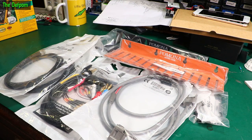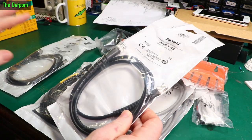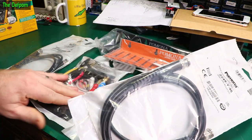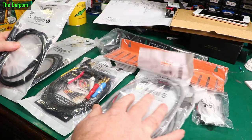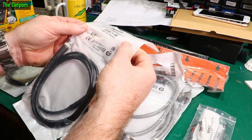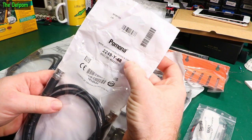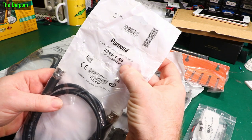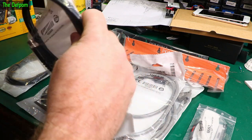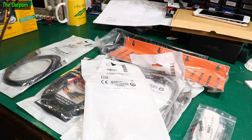I'm going to go through and have a look at some of these things. I think we'll look at the most basic thing first — over here we've got some BNC cables. I asked for two of each thing because I like to have pairs. So let's open one of these up and have a close look. This BNC cable is the 2249Y48, which is an RG223U-based coax.